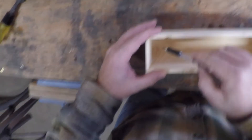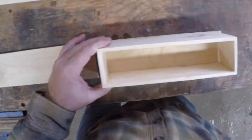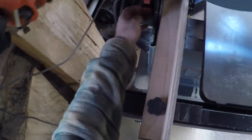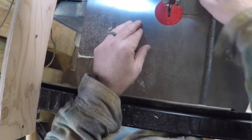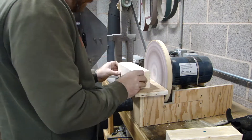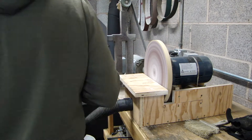Now I'm tracing out the last two sides of the box. If you make your box square and straight you don't have to cut it to fit — you can just measure it — but to me it's just as easy to slap it together and then cut that piece to fit. I've already traced out the box sides and I'm rough-cutting them with my compound miter saw. Once I get those roughed out I'll take it to the bandsaw and cut pretty close to the line, then finish up the sides on the sander. I didn't realize when I was recording this that it wasn't very in frame — I'm learning. After gluing up the other sides I'm just flattening it out and smoothing it the rest of the way.